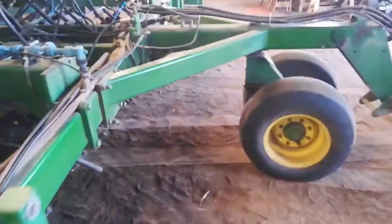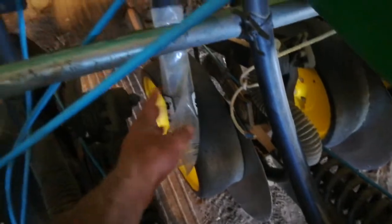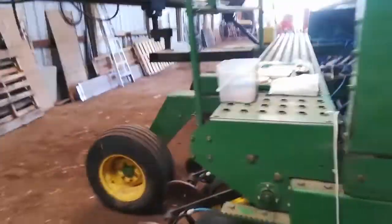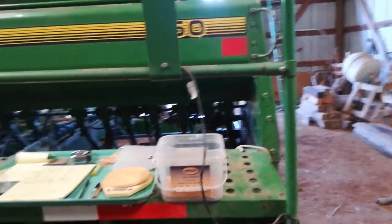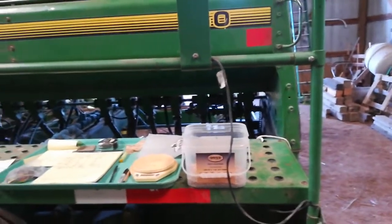The first thing I did was install the half speed gears. Once I had that in, I blocked off all of the seed cups except for four. Here is one of them and I put a bag over each of the four — there's one there, one there, and then two more on the other side. To get a rough sense of the rate, I first used the wheat settings in the book, which suggested I should be down at four or five, but I ended up being at eight or nine initially.